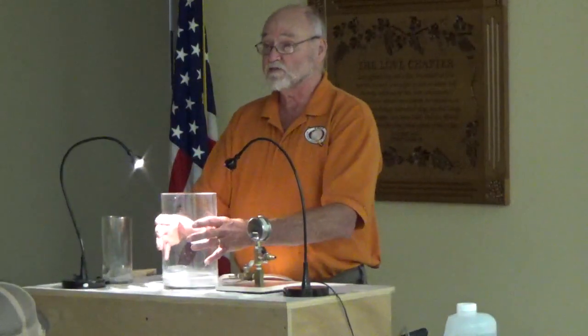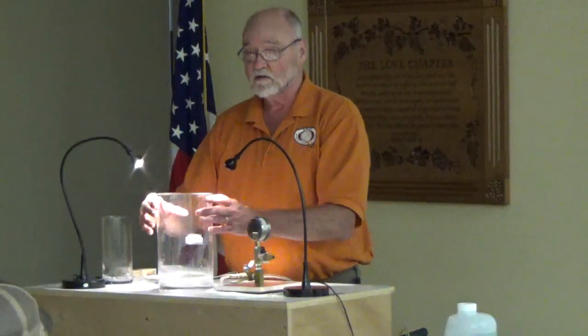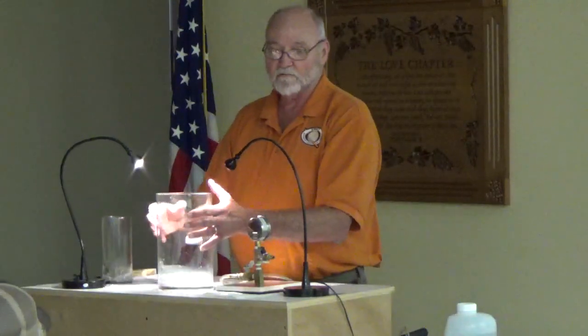Yep, you can use a pickle jar. But I guarantee you Atkins Pickle or whoever is not gonna guarantee that it's not gonna blow up on us. It hasn't yet, but you gotta be careful. That's why you use a round shape. It's physics, the pressure. There's a lot of pressure on this. You don't think that, but when you have this under vacuum, normal pressure is 14 point something pounds per square inch, and you put that much pressure over that area, because it's trying to get in. That's a lot of pressure going up against that glass. So you don't want to drop it or have something hit it and break it. It's not gonna be fun.